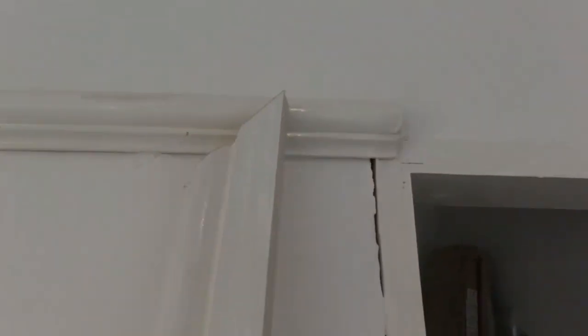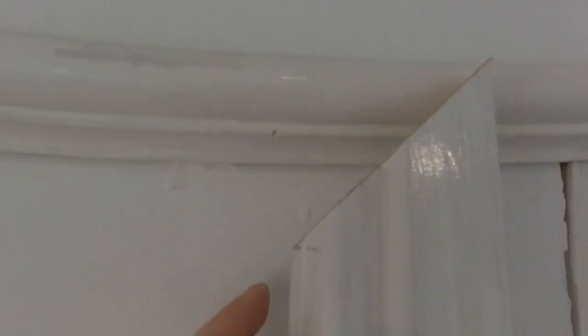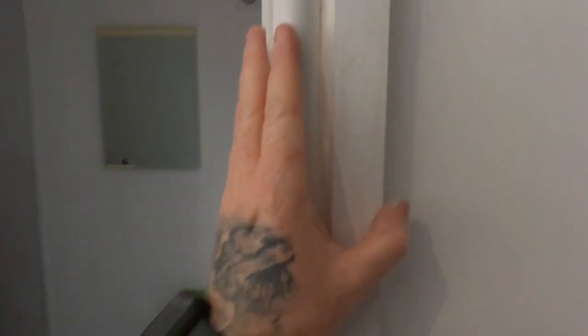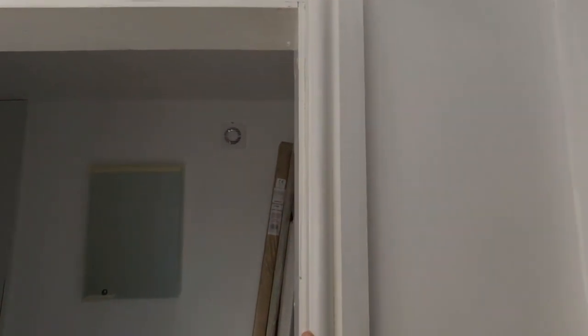So that's what I've done a minute ago. You measure to the internal side - 2m. And then from there, a 45-degree angle going upwards - like so. And all you do then is butt up the architrave to your marks on the wall. Job done.